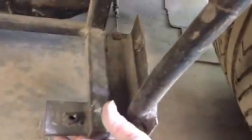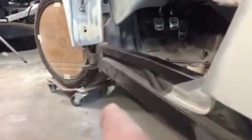And then the rocker panel comes back, and up underneath you can see I have a hole there, and out back I got another hole, and that bolts the rocker to the quarter panel to a flange off of the support steel. Down at the bottom there's another tab, and that bolts the rocker up underneath here too. So the rocker panel is here through a support, and up front where the quarter panel is, the front fender up there. I have separate door jambs.